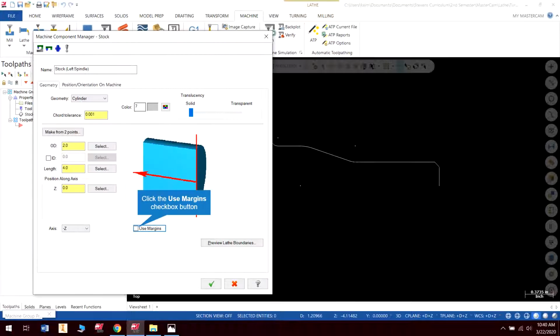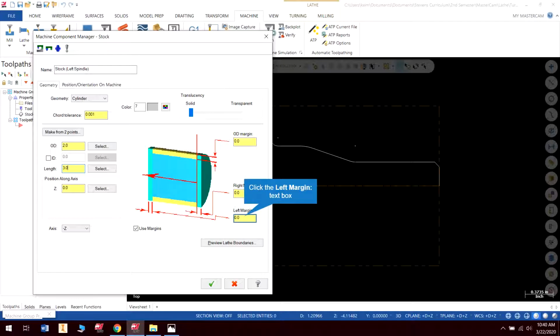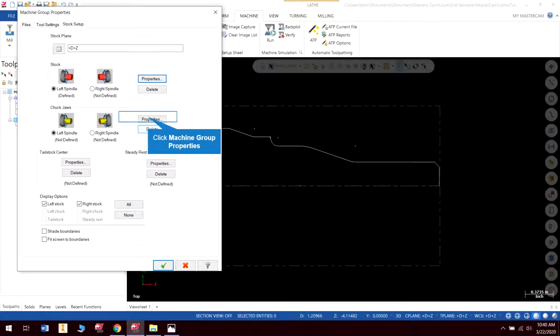So it's already in the DZ plane. It didn't update for this one. It'll update for the next one. So my left margin, let's make this parts 3.0. Let's make my left margin 2 inches again, as usual. Right margin 0.1. And hit check. What you'll notice is in the next video I do, when I do the exercise, this stuff will already be pre-populated, the stuff that I changed in there.